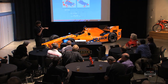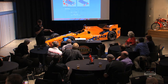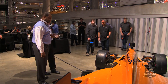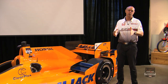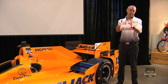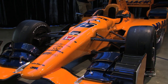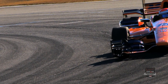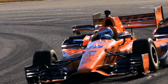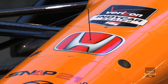Finally, another challenge which makes the Aerokit story so much more interesting for us aerodynamicists is that IndyCar have decided to mandate a change in the underbody regulations. We've had to remove what's called the side walls from the underbody and also the vortex and downforce generating strakes. So we've been dealing with the holes in the floor, the changes in the underbody, and trying to come up with a race car that's drivable, fast, and has great balance. We're really looking forward to the challenge of developing and tuning this complex package in the coming season and beyond.